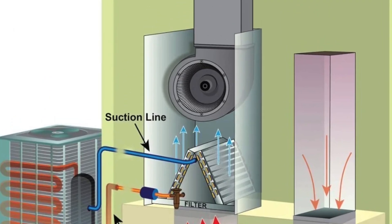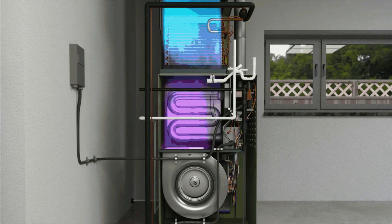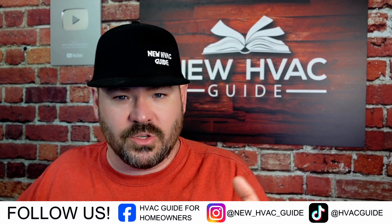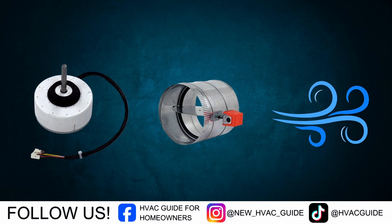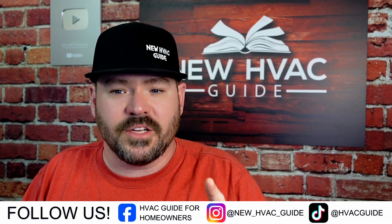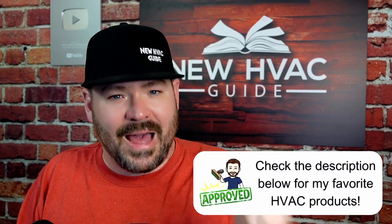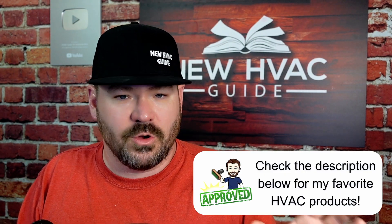We're pushing all kinds of fresh air through the system — not ventilation specifically, although that's part of this — just fresh air through the system so we don't have ductwork sitting there with pockets of flammable refrigerant. That's what we're trying to avoid. So it's going to turn on the indoor fan motor, open all zones, and bring air through from the return. The other thing it does is turn off all accessories. If you've got an electronic air cleaner, a UV light, or similar accessories, this board will be wired in series, break power, and kill power to those accessories. So: indoor fan motor on, outdoor unit shuts off, dampers open, accessories turned off — that's the four-step mitigation sequence.